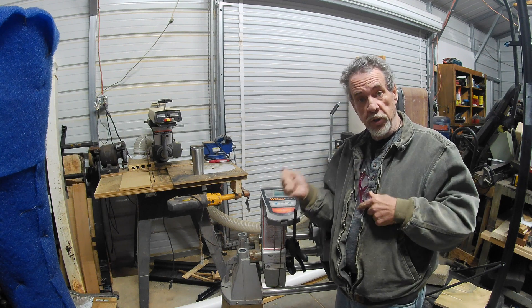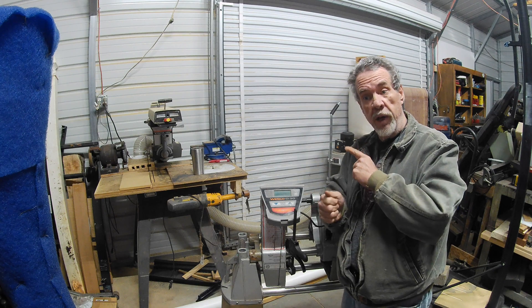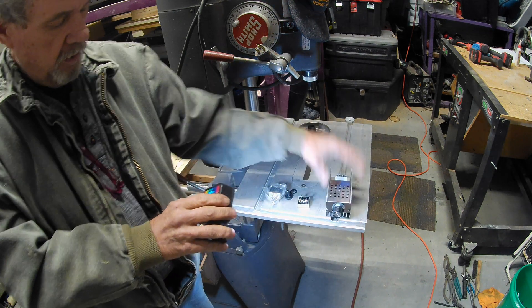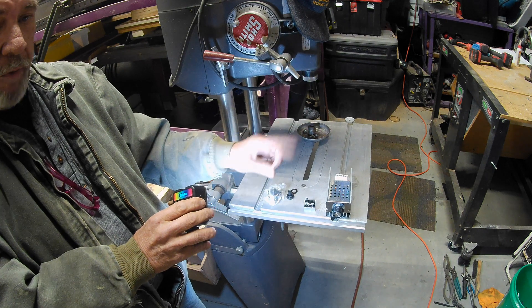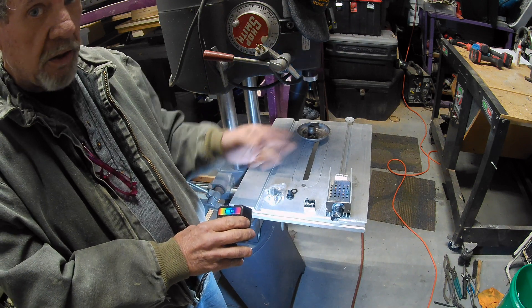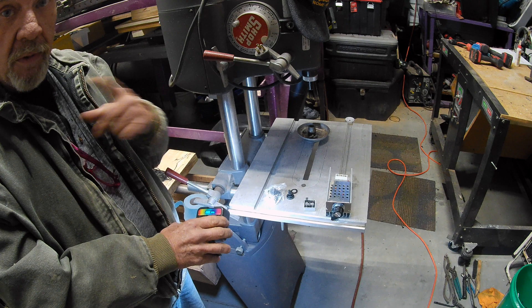Let's get busy and get in here and put these new parts in. Let me show you what all we're going to put in it and then we'll figure out a way to get it all in. We need a SCR speed controller, basically, is what it is. And then we need a rectifier. And then I need a switch to reverse this thing from forward to backward because I need my machine to change directions. And other than that, a couple of wires and hook it up to my DC motor and it should work.